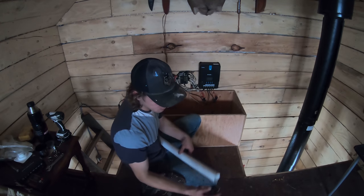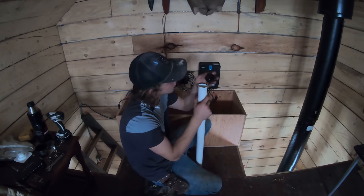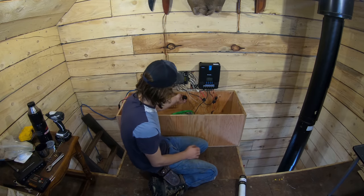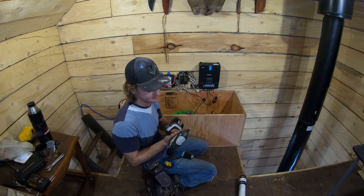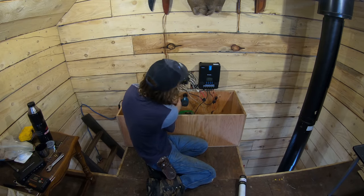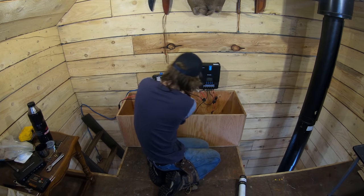I'm putting this piece of PVC out through the outside, so it's going to have to be drilled through the wall. I'm not looking forward to it, but trying to get it done. I want it up high because hydrogen gas rises and that's what we're trying to vent from these lead acid batteries. I don't want to go too high though — ideally on the lid, but then it would be an issue closing the lid.